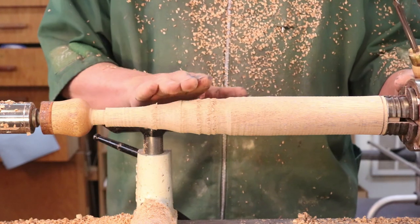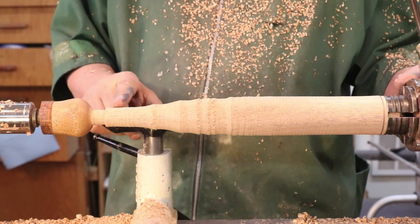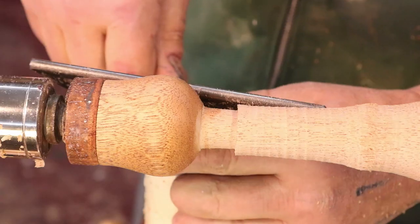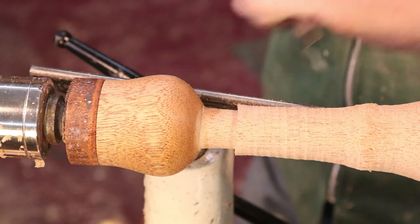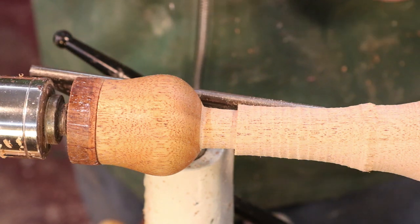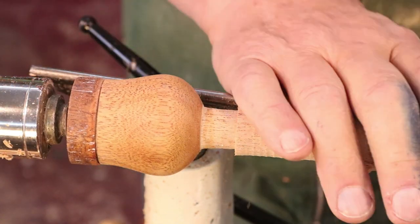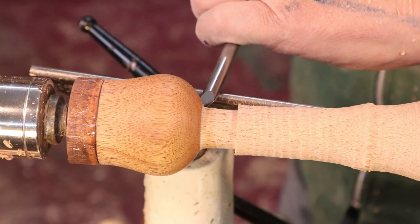What I've done here is taper my stem area down to the place where I'm going to start my stem and establish the thickness — this allows me to get my hand and a tool in there. I watched several videos on making a long stem goblet: Jimmy Clues has one on YouTube, Bob Hamilton has a very nice one, and Mike Walt has several videos making goblets — Mike really sort of inspired me to do this. I'm questioning my judgment though — 16 inches — but I'm glad to be past the bowl. I'm going to take my point tool and establish a bead right here.